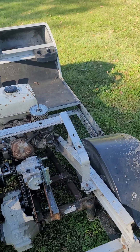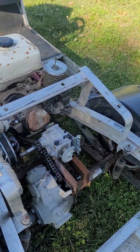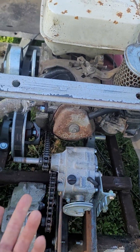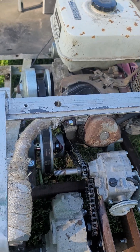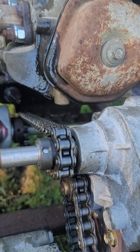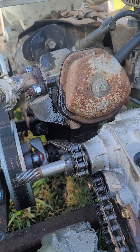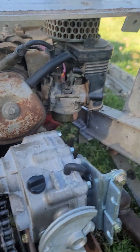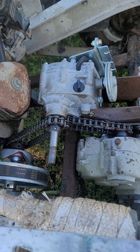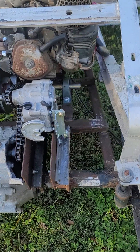The factory axle is a 12-to-1 ratio. This is a 1.2-to-1 Chinese go-kart gearbox with reverse. I had to create an overdrive — I have a 14-tooth driving a 10-tooth to speed up the transmission. So I have an overall final ratio of 9-to-1, which gives me a top speed of 18 miles per hour, which is pretty terrifying.